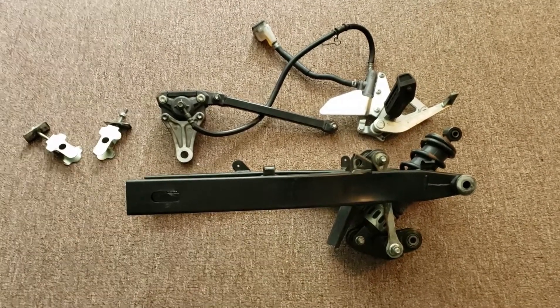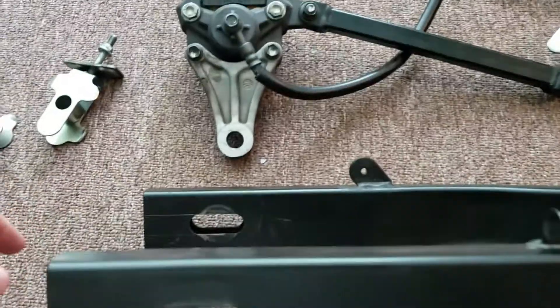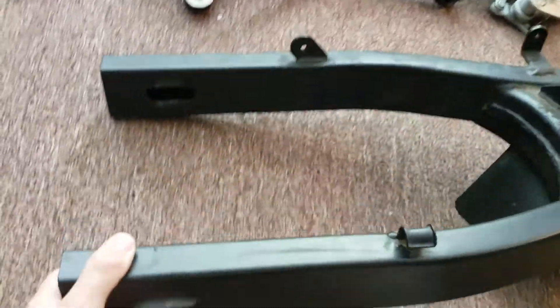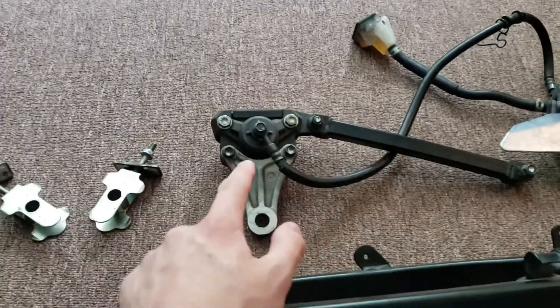Here's my rear swing arm. I had to take off my rear caliper brake unit due to the fact that when you place the hub motor in between this swing arm, it will not fit and the caliper itself actually bumps up into the hub motor.